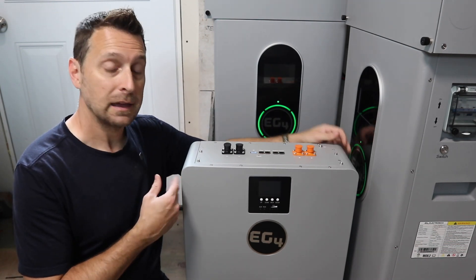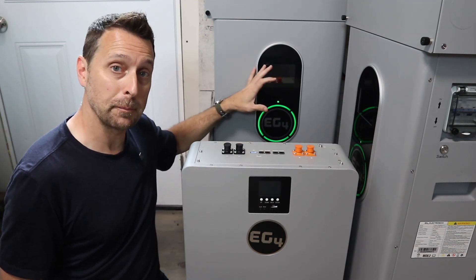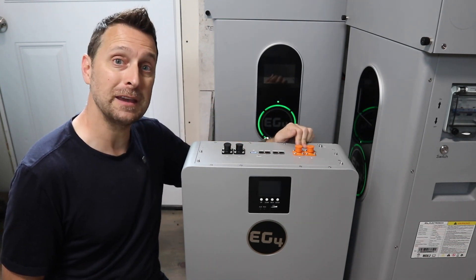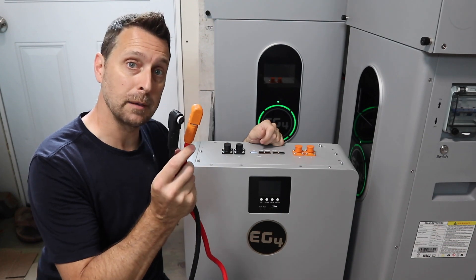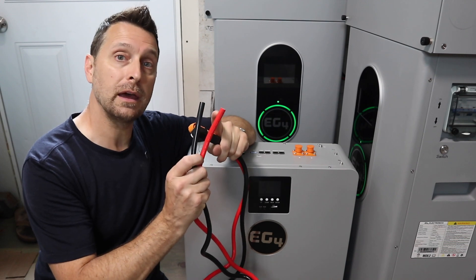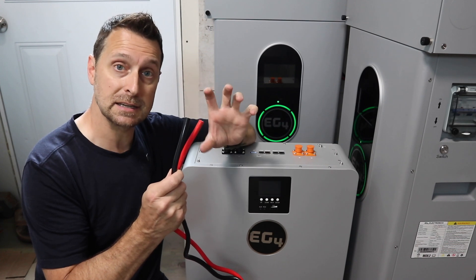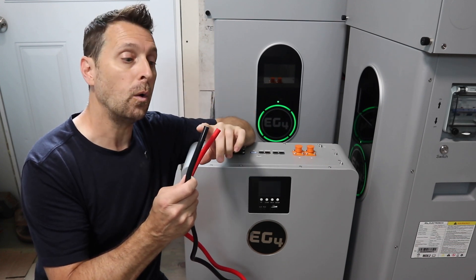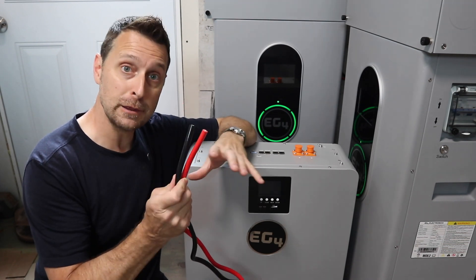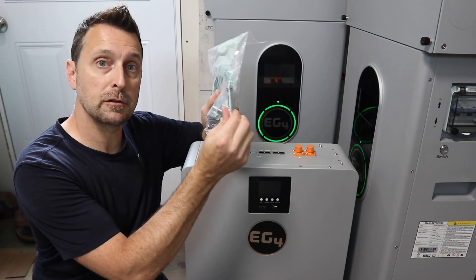It's about 18 inches wide and 25 inches tall and 7 inches deep. Similar to the large wall mount battery, what's really cool is internally these have two 150 amp bus bars. Then your battery cables have these Amphenol connectors that just push on, and an open end on the other end — so you can either put lugs on it to connect to the 6000 XP directly, or just cut back the insulation and insert them into the 3000. It also comes with a communications cable and concrete anchors.